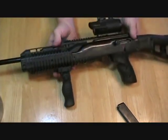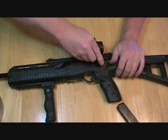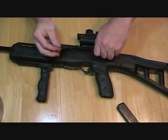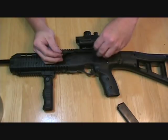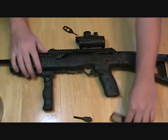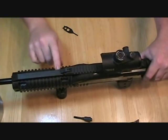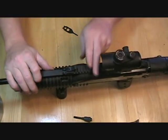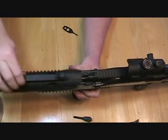The first thing I'm going to do with the wrench is take off my charging handle. The charging handle comes off — it's just a little bolt with a corrugated handle on it. The next step is there's a little lever on top here, on top of the barrel shroud. You just pop that up like so, and what that does is loosen the barrel shroud. The barrel shroud then slides forward and off of the barrel.